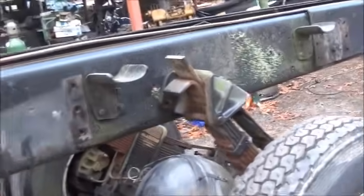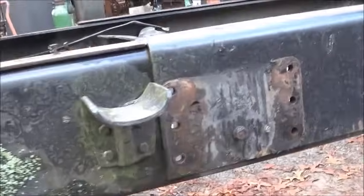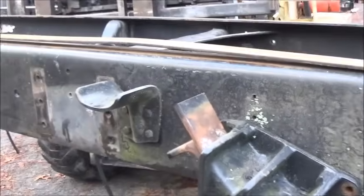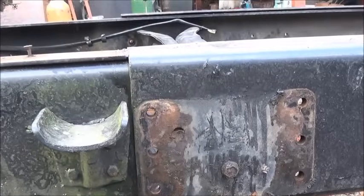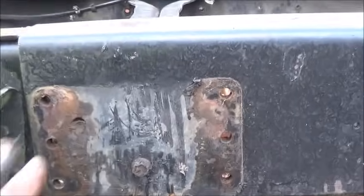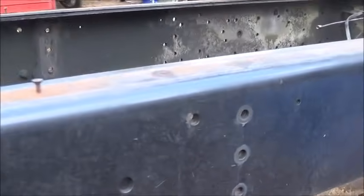You see we got the rear end loose. So we're gonna take these off, and then I'm gonna go ahead and make a stick to mark to go 50 inches forward of this. And the back ones should bolt right back in place where the front one was. And we won't have to change any of these holes. Redrill these, and then I think I'm gonna be able to get by with using these holes for the cross member, but I'm not sure.